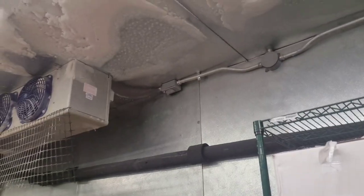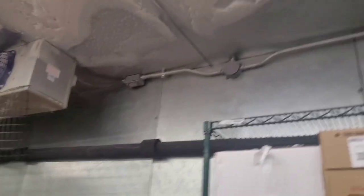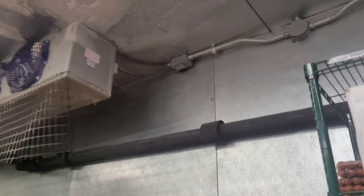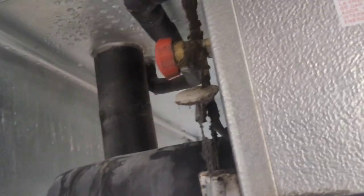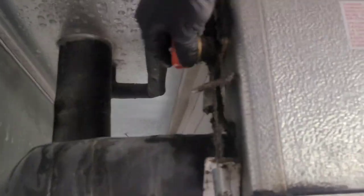After I called — there's a company that monitors these remotely — so if I was to turn these off without calling them, they would call in another service call. So I call them and I tell them I'm working on it for four hours so no service calls get made. Now I can shut these things off. Usually when you shut the switch off it stops blowing the refrigerant, but when that doesn't happen, turn these off. Just don't forget to turn them back on when you're done. So now that both manual valves are off, let's get started pulling these covers off.